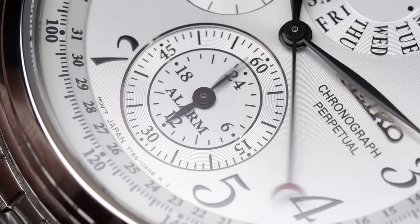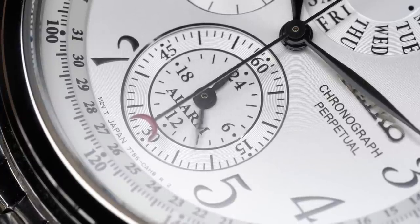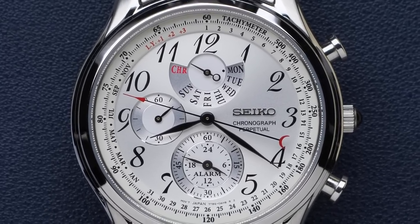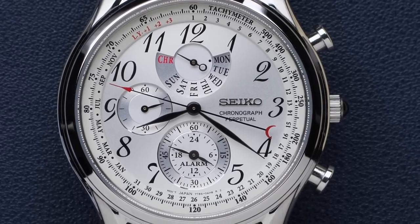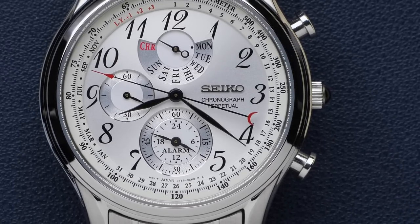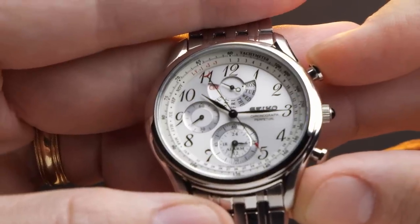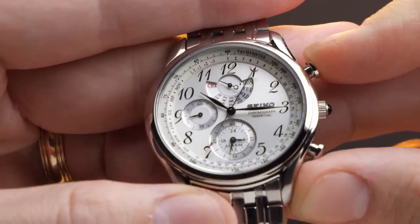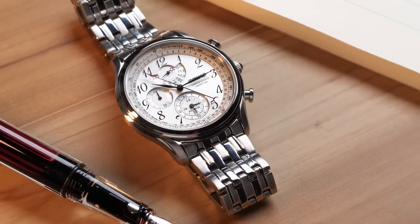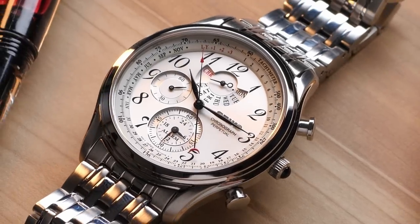The alarm section of the clock is basically a separate clock in the six o'clock sub-dial. Seiko's intention is for you to manually synchronize that clock with the main time on the dial, and then in one of the modes you can select a time for the alarm to go off. But since that little clock at six o'clock is independently settable, you can also set it to any time you want — it doesn't have to be lined up with the main time. The perpetual calendar is also a slightly confusing but very interesting and useful complication. What appears to be a very long double-sided second hand is actually a dual-purpose pointer: on one side you have an arrow for use in the chronograph, and on the other side you have a moon that functions as a pointer date complication. When the chronograph is not in use, it will point to the current day of the month. When you press the top pusher, the moon will first swing around to indicate the current month, and then the second push will tell you how many years it's been since the last leap year. Since the watch knows which month it is, how many days are in each month, and whether or not we're currently in a leap year, the watch is capable of keeping the calendar in sync on its own without any monthly adjustments until February 28th, 2100.